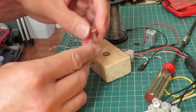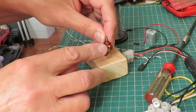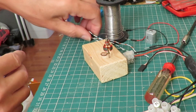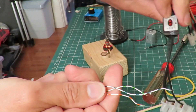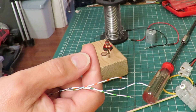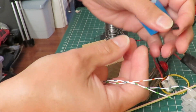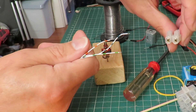So what I'm going to do is solder three leads directly onto those tags, because that's a convenient way to do it. Then take those leads and connect into my ESC. I've got a servo tester that I can plug into the ESC so we can control it, and connect the battery up to there.